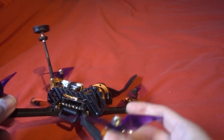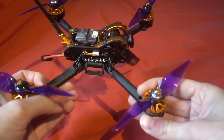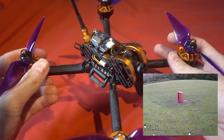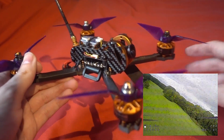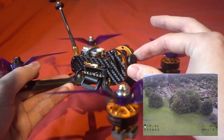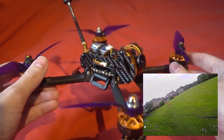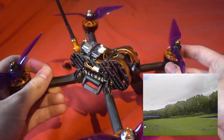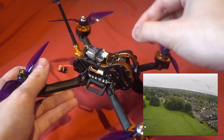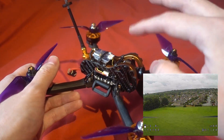Starting with the Tyro 99 — $99, the cheapest of all of them without a coupon. My biggest issue with the Tyro 99 is the camera. It's got a very narrow field of view. It's a CMOS camera, but it does make it really difficult to fly. I switched this one out to a 2.5mm lens to get it a little bit wider, but it was still fairly narrow. The upgrade for this one is to switch the camera out, but then you are spending more money. And when you do switch the camera out, you get a problem — if you use the same cable you will get the on-screen display flickering.